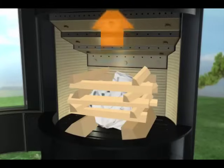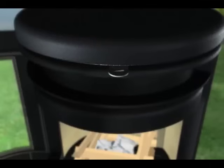The main objective when first lighting your stove is to allow the heat to quickly escape into the chimney while also establishing chimney draft. Take a moment to stop and check that your primary air control is fully open.